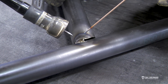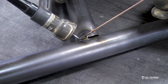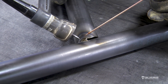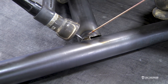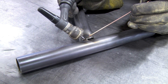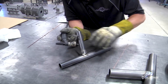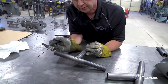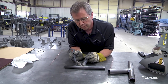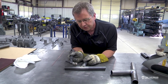It's the only way to get across there and fill that gap. With a little practice, you can take that puddle and drag it over to this side, get your heat in there, make sure it's penetrated, then go back across and get it over here, and drag it back and forth all the way around. You'll have a nice looking bead when you're done. It won't look the same as a nice tight fit, but it will have very good quality and very good penetration — it just takes practice.